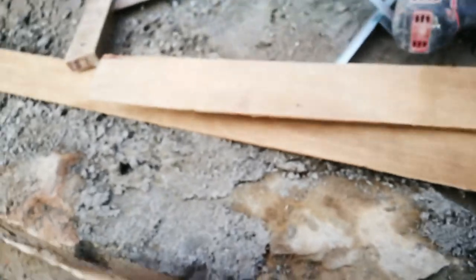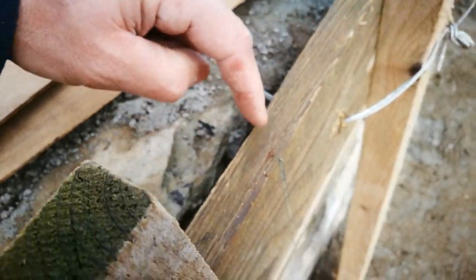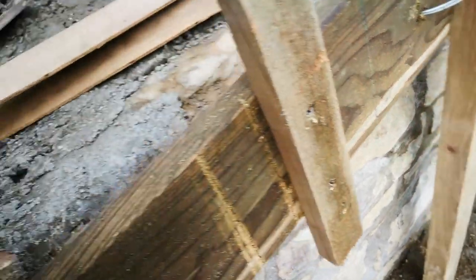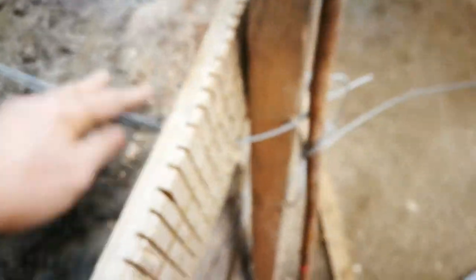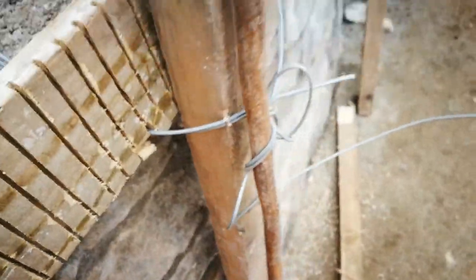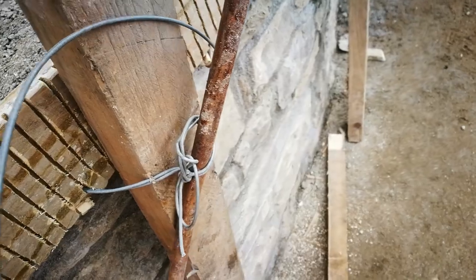Because it's snapped, I just can't bend it anymore. So what I'm going to do is cut a mitre here, take it down. I've got a guide so I can get a right angle and cut a mitre there, then reform as I go in. To get the wood to bend, it's been slotted in the back. Then to pull it in tight, I've got a wire around a stake and across, drilled through below the level of the concrete finish — that'll be covered in sand, which can be pointed up afterwards. I've done it in a loop, twisting it up to hold it all in place.